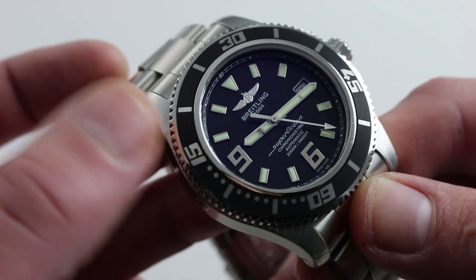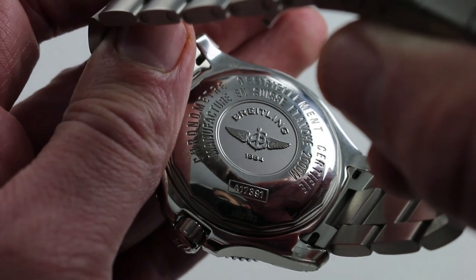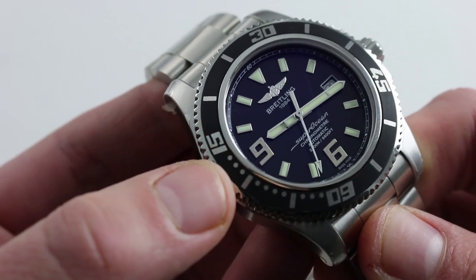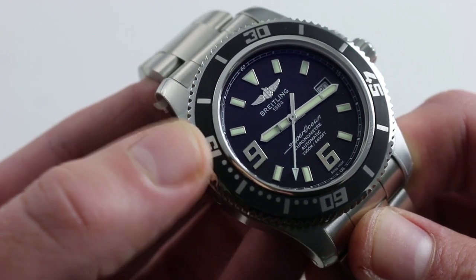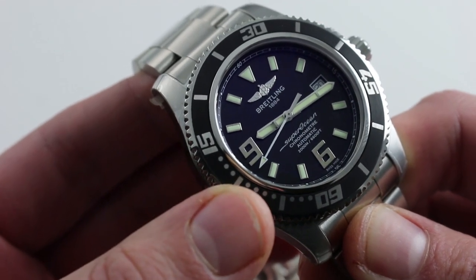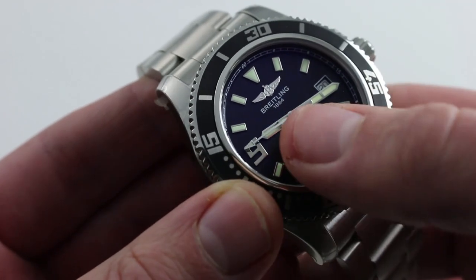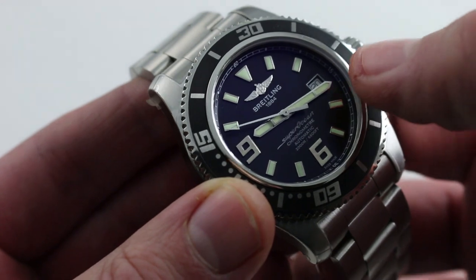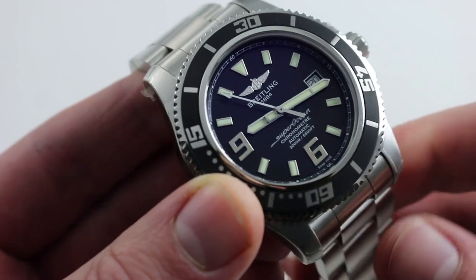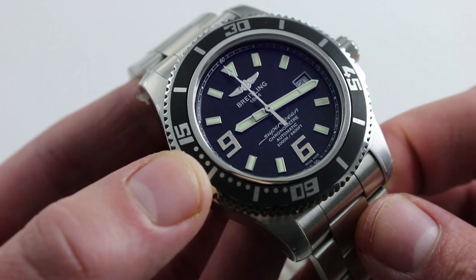It's very impressive — it's what you expect of a dive watch. The caliber inside is Breitling's tried and true chronometer-grade Caliber 17, an ETA 2824, and again, chronometer-grade. It's thicker and tougher than the 2892, making it just about the perfect automatic caliber for a dive watch like this. It offers a 42-hour power reserve and smooth bi-directional winding. Pulling the crown stops the balance, allowing you to synchronize the seconds hand to the second and minute against a reference time. There's also a quick-set to cycle the date, so you can rapidly correct it after an irregular-length month.